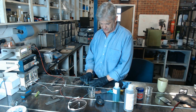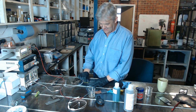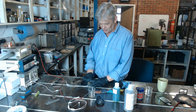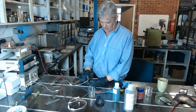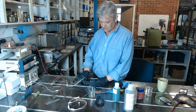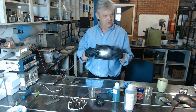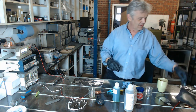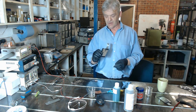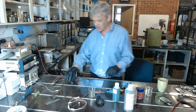The challenge is to get that bright plate after you've finished, because the control of these things can be quite difficult. Here, all we're doing is rubbing that wand over the surface, and when we rub that, we get that result — a nice, bright, shiny zinc plate. If I'm a bit more careful, then I'll get something even nicer.